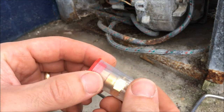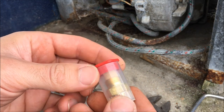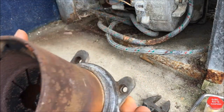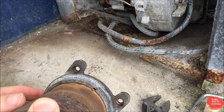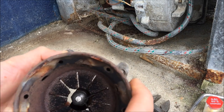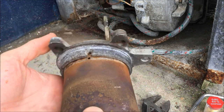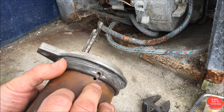So this is what a new jet looks like. I've been told not to touch it with my fingers and to fit it using the plastic cap, which I will do. This old one was held on to this body with two screws — two M6 threaded Allen head nuts with bolts. You unscrew those to get access to unscrew the oil pipe connector on the back. Then you have this thing off in your hand, and it had a screw on each side which were a bit mangled from a previous service — I don't know who did it.